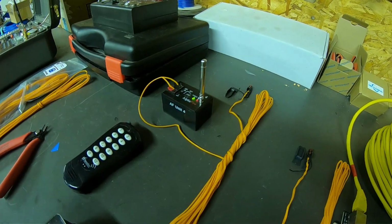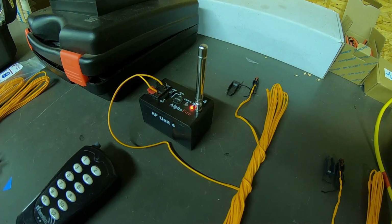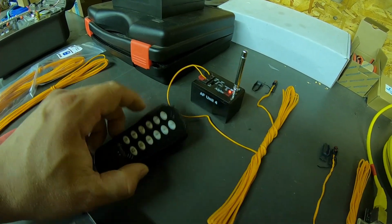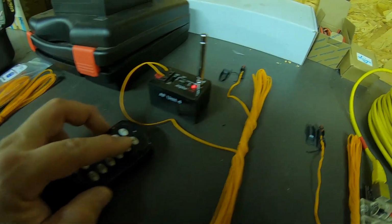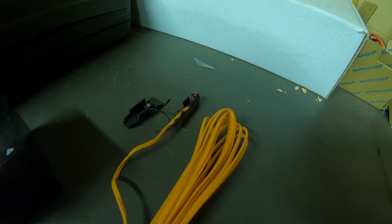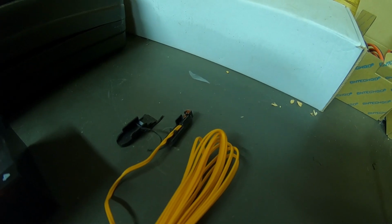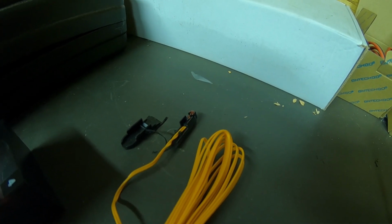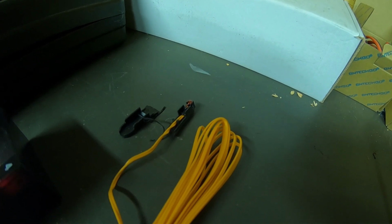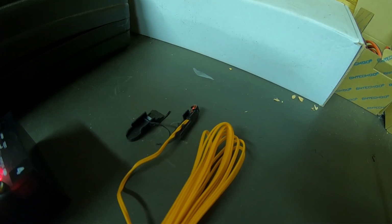Okay, we're going to start off here with the RF Remotech with this Alpha Fire unit. We're going to put it into ARM here. This is ID4. I have programmed to this RF remote here. So I'm going to push 4 here and we're going to watch the nichrome wire. Ready? 3, 2, 1. Here we can see it's a fairly weak burn there off the nichrome wire. We might be able to actually fire it again. It hasn't burned all the way through, so we might get a couple turns out of this.